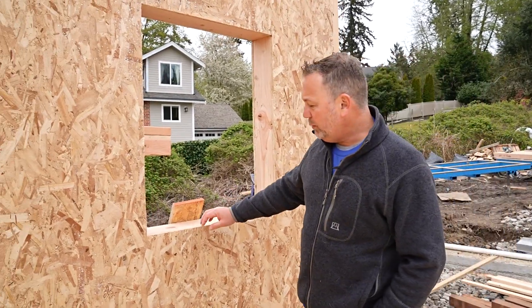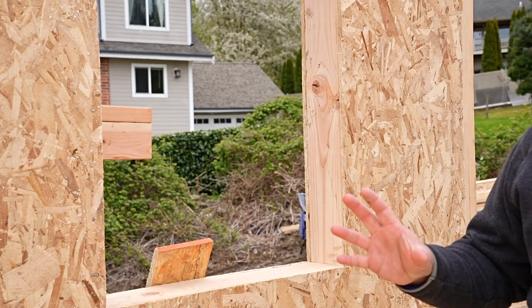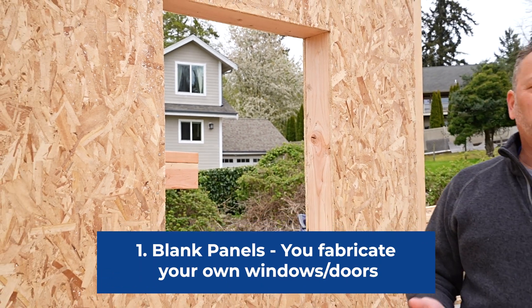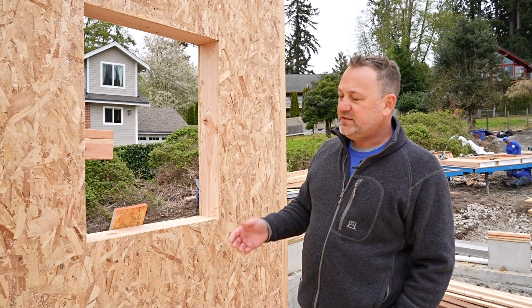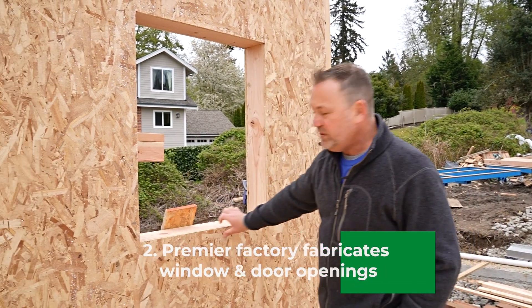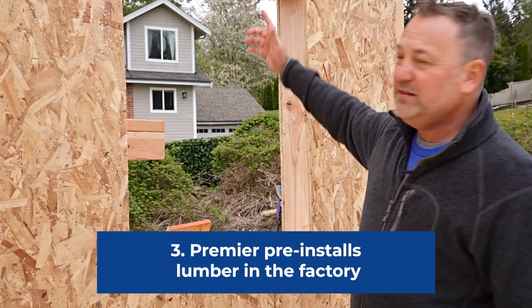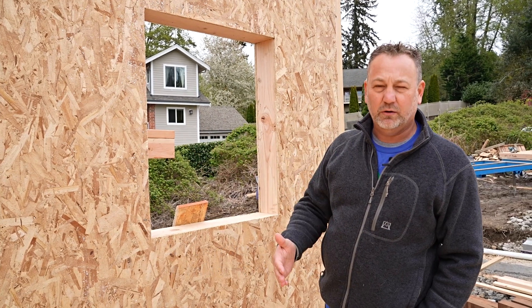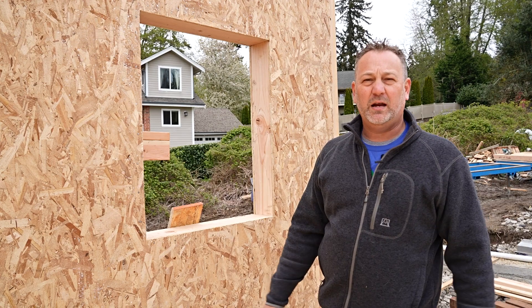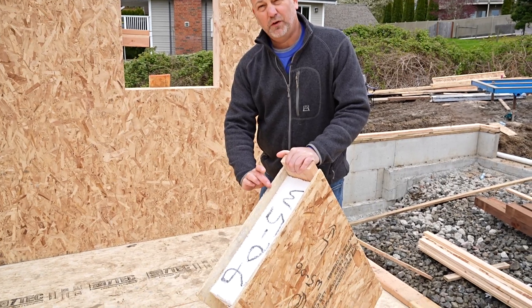In the factory, we've pre-installed the lumber around the window or door opening. We have basically three different ways we can manufacture panels. Number one is blank panels, where you fabricate your own windows and door cuts. The second is for us to manufacture the opening and recess out the foam for the insertion of dimensional lumber. The third and most complete option is for us to pre-install the lumber in the factory, so when it comes off the truck it's ready for assembly or installation on the plate line. This panel is recessed an inch and a half for the insertion of that lumber.